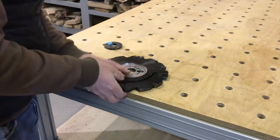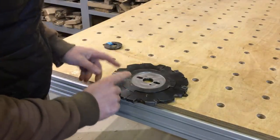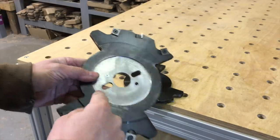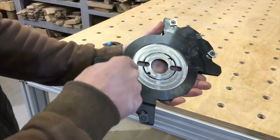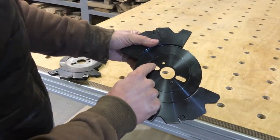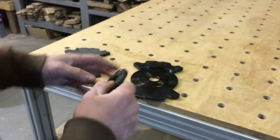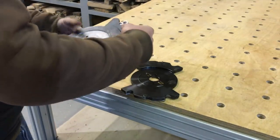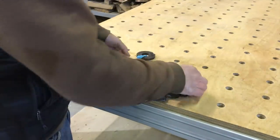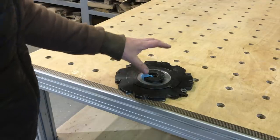So some of you have seen this before if you watch my channel, some of you haven't, so I thought I'd just show you it. This is an adjustable groove cutter from Felder, and I've actually had it adapted at a machinist. I've had it rebated here, and a bigger rebate on the back to allow it to fit perfectly on my spindle. I've also had the Felder holes, which are much closer, elongated by an engineering firm. You can use these inserts to make it up to about 20 mil. It says on here, 12 to 20 mil of rebate on a 30 mil shaft. So it's adjustable, cutting really quick, very safe, very easy to use, and that's what I decided to use to nibble away at the oak braces.